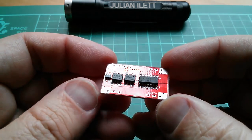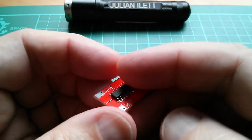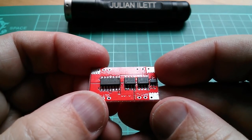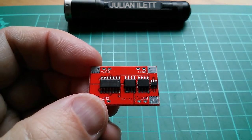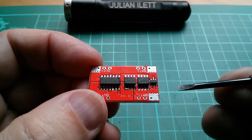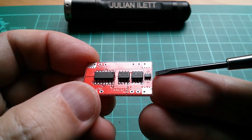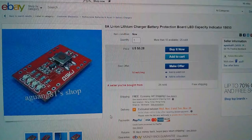And several chips on there. Oh, an LM324 op amps. What are these two? BA7G22. Are those 4410? I've got a feeling those are MOSFETs. Yeah, they probably are, because you can see that four pins on one side are commoned and three pins on the other are commoned, and then there's a gate signal. So this is something to do with lithium cells, is my guess, but I can't remember what it is.